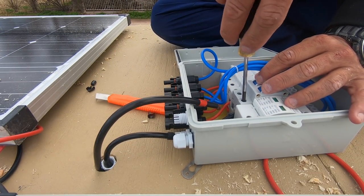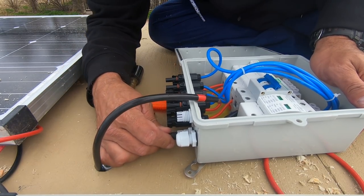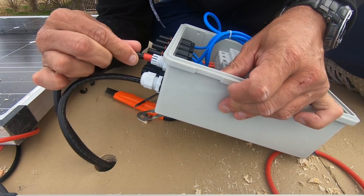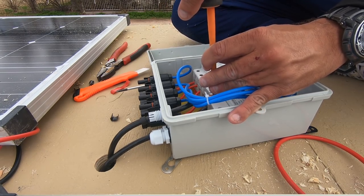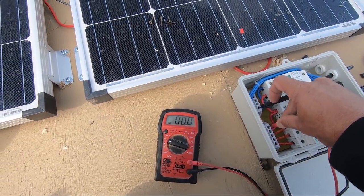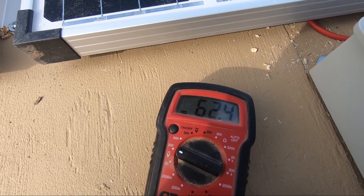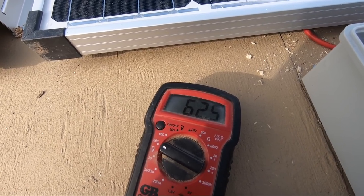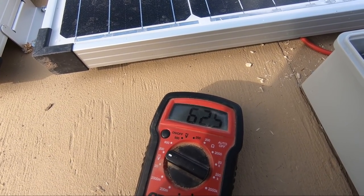All right, that's one — push that down good. This one's going to be a bit harder because we've got to turn a corner. We've got the meter out here, so let's see what we got. 64 volts — 63, 62 volts coming into it. That is awesome, and it's a cloudy day. I can't measure current this way, but that's what we've got coming in. Now we can hook this thing down and seal it up.